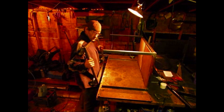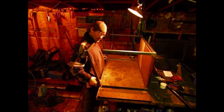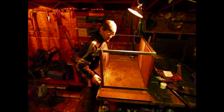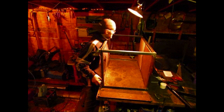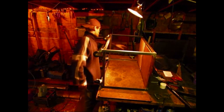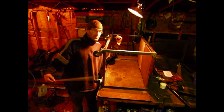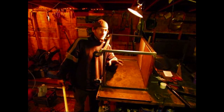Now since the height of just the steel on the cart is 20 inches, I'm going to make sure that I measure inside here at 18 inches from the top on all four corners. I'm going to measure the inside here, make sure that that's 18 inches, and then we're going to tack it, go over to the next corner, measure it all out, tack it — do the same thing with these two corners here — tack everything before I weld it all solid.